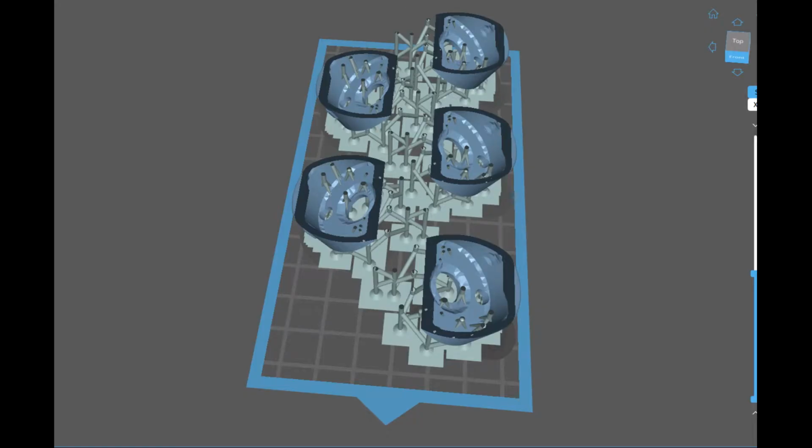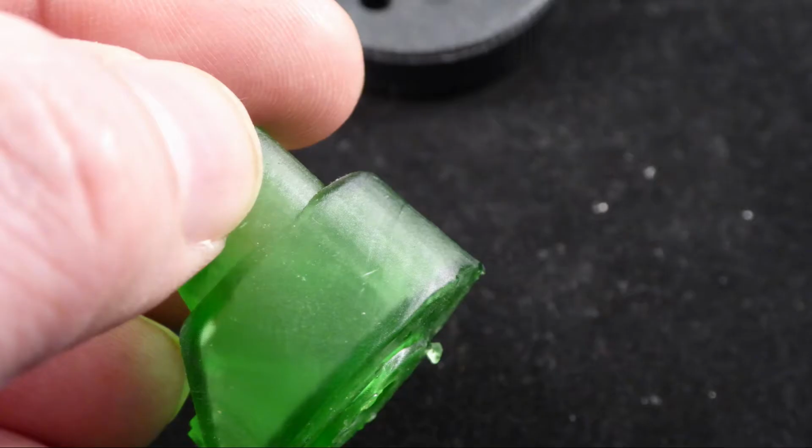Rule 4. When slicing your model, make sure there's a hole at the bottom edge of your print when hollowed. This is to reduce suction on your part. Remember, liquid is incompressible. When the part lifts, if there's no drainage hole, it's going to pull a vacuum. Vacuum is one of the biggest problems for parts.